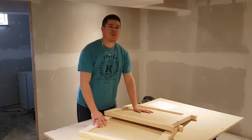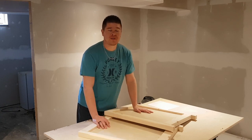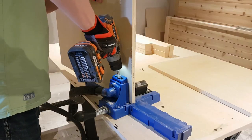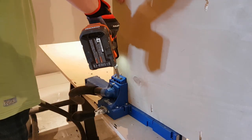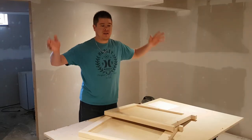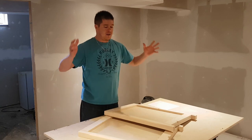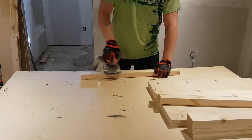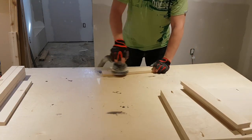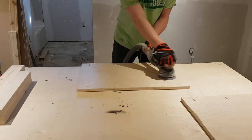After that, we're gonna take our plywood and drill some pocket holes in it. That way we can attach it to our 2x2. From there, we're just gonna give everything a preliminary sanding. It's much, much easier to sand everything while it's completely torn apart. So go ahead, give everything a sanding right now. Make sure that when you sand the plywood, you only give it a quick buzzing with like 220. It doesn't need very much, but you do not wanna go through that veneer.